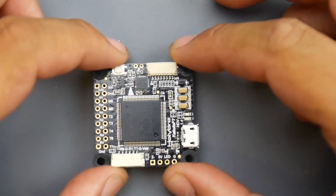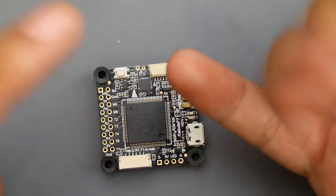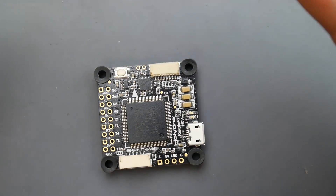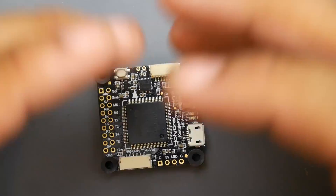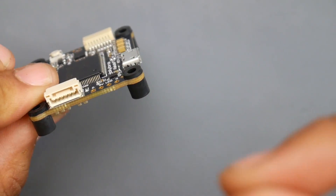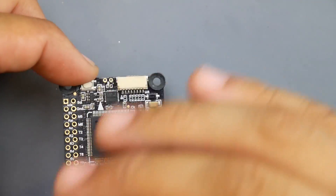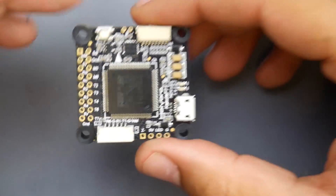This is mainly aimed for the DJI FPV system, because it has everything that system needs. It has filtration and an 8-volt, 2-amp regulator that will go directly into your DJI FPV system to give it the perfect, cleanest voltage. Because with the DJI FPV system it still doesn't take any sort of telemetry, so it just does everything by itself. There's a connector here for that — they have these connectors ready-made for you. If you have that system, you just plug that in to your DJI FPV HD system and you're up and going. You don't have to worry about VTX power, where the camera goes, or where the VTX yellow wire goes. On the other side you plug the ESC — they look alike, so that's where the ESC goes.